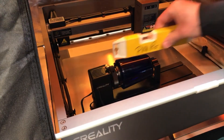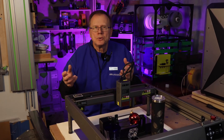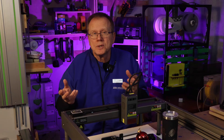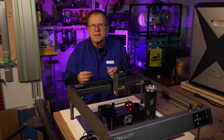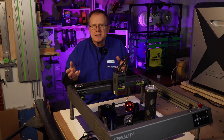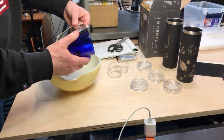The circumference is 251 millimeters. I wanted to personalize the glass with 38-millimeter-high letters, so I drew a rectangle in Lightburn 38 millimeters wide by 251 millimeters high. I typed the name 'GG' in Lightburn, rotated the letters 90 degrees counterclockwise, and centered them in the rectangle. I didn't want to sacrifice my glass, so I found a recommendation of 75% power and 7,500 millimeters per minute for a 20-watt laser on YouTube and decided to try those settings. I tried engraving the blue glass to confirm whether it would engrave. I knew clear glass doesn't engrave with a diode laser because the beam passes right through, but I wanted to see if the blue color made a difference — unfortunately it didn't work. So my next step was to place laser paper on the glass by cutting a section and placing it in warm water.